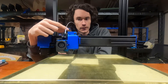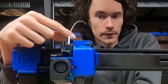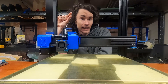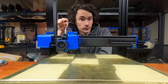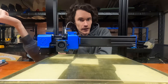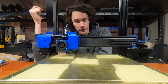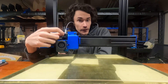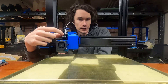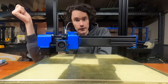What do I mean by extruder arm wobble? What will happen over time is the extruder arm will get loose and start to wobble back and forth, and that's a problem because the filament has a hard time staying in the groove. The extruder arm jumps off, even if it has a grooved bearing. It loses tension, your print fails, and a lot of people chalk that up to a clog — they're not one in the same. Thankfully, the fix for this is relatively simple. There are numerous 3D-printed shims that you can install on the side. Thingiverse, for example, has quite a few of them.